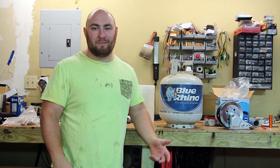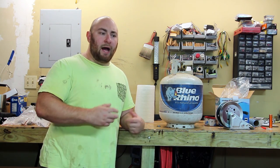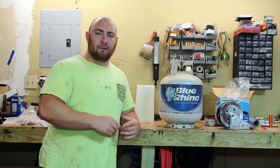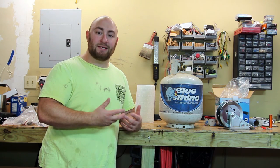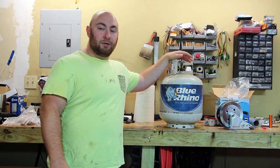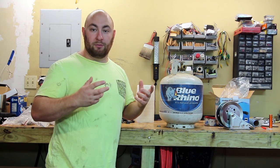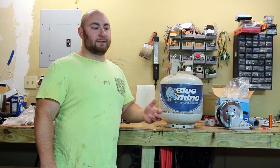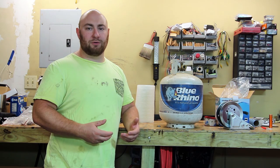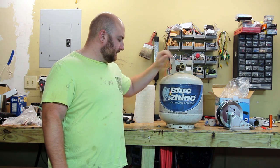You might say, well what's the big deal — why do you want to melt down aluminum cans? Scrap values aren't worth anything anymore, so I end up with a lot of aluminum scrap — frames, swing arms, stuff like that — that doesn't have a whole lot of commercial value. It ends up taking a giant pile in my backyard, so I've finally gotten around to building a forge that will allow me to cut it up and melt it down into pure number-one aluminum ingot. Those ingots can be cast, they can be sold — there's a number of things you can do with ingots that you can't do with the raw frame material.